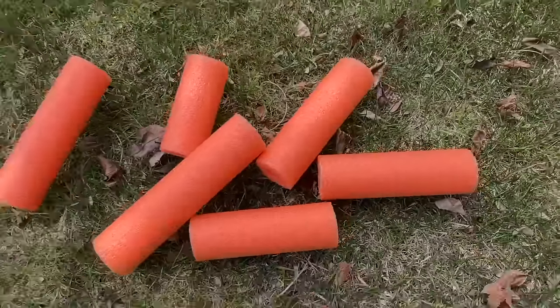To begin this project, choose your solar light set. Next, using 1/2 inch by 3/4 inch board, measure and cut 8 8-inch sections. Using a brad nailer, I secured these together, creating a square, but if you don't have access to this tool, you can always use a screw.